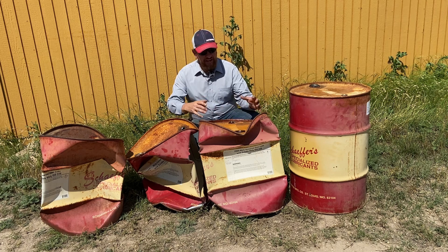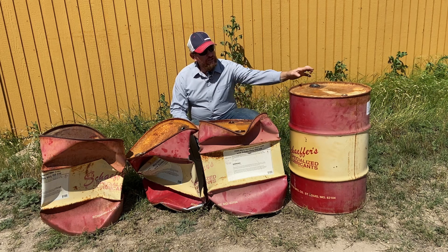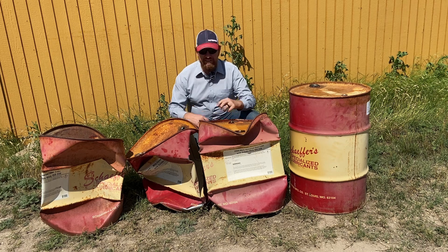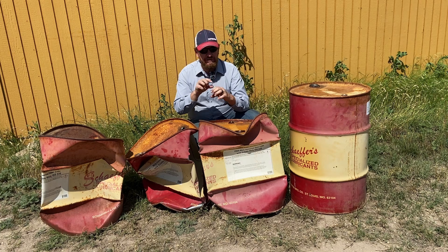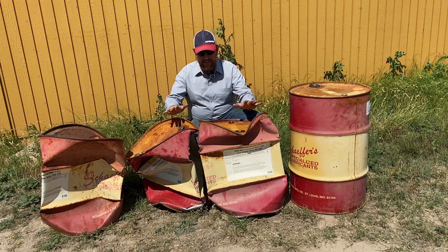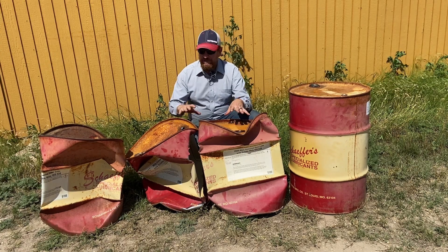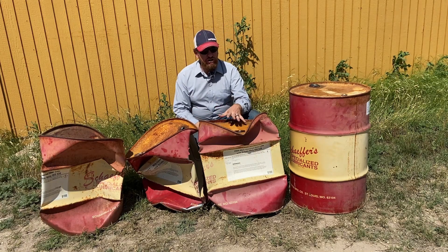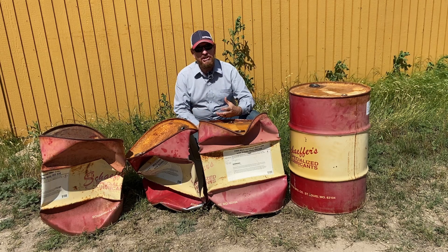This metal is a very large container, and even though it's fairly thick steel, compared to its overall diameter it's very thin. Our copper tubing is not going to do this, because it's a very small diameter and the tubing is very, very thick relative to that diameter. Even though it's a long length of tubing, it's not going to crush like this, so you don't have to worry about that. As important as this is to see the pressure difference, this doesn't really show everything we need for a vacuum. This does show us removing the molecules and the importance of the pressure.